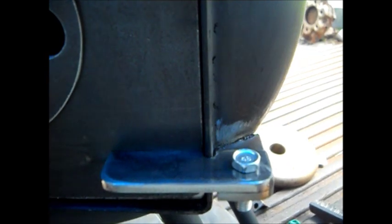That's how we made our hinges. All I have are pictures of a little piece of metal and the measurements. I started out with a notch there, just a straight notch, then I tapered it so it doesn't hit this when it opens. But I built it with the notch in it, then I took the bolts out. It wouldn't open until I took the bolts out, and then I fine-tuned that. I welded it underneath so it makes it look better on the top.